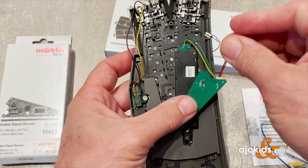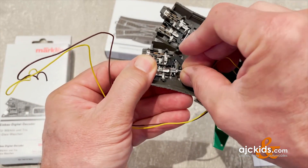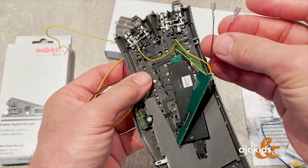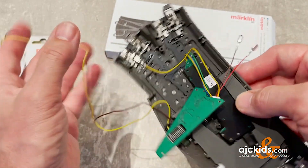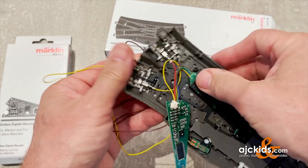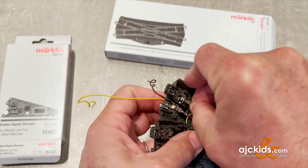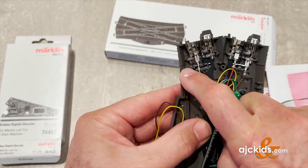So those are the three wires that go from the decoder to the turnout motor. Now I have to power the decoder. Since we don't have a separate power circuit, we'll connect the yellow wire to the turnout and use digital power to switch it. The yellow goes on the separate tab on the left-hand side. Then all you have left is the brown that goes to the outer rail and the red wire that also goes to the center rail. I'll connect the red to the center rail connector and the brown one goes to the outer rail.